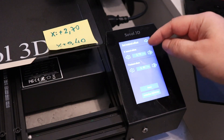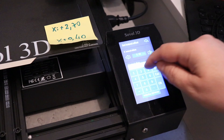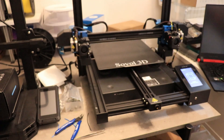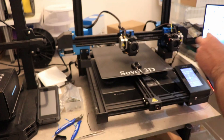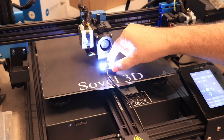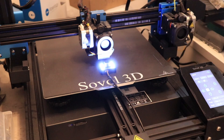I will set everything to zero in the hotend offset settings, and just in case I wrote down the existing values because I should get very similar numbers. I already cleaned the nozzles and now I will home the extruders. I am connecting the camera to a USB port on the laptop. After homing both extruders, I am placing the camera so it is not in the way of the extruder, just in case it requires another homing. Now I am moving the Z coordinate to 13mm.